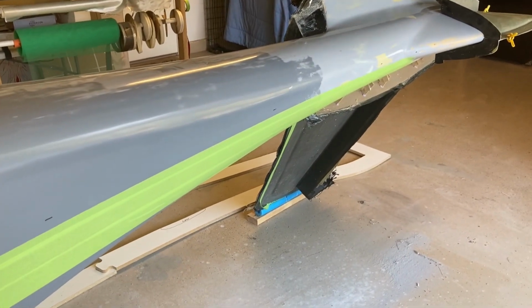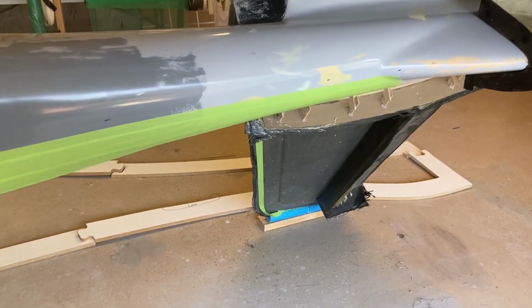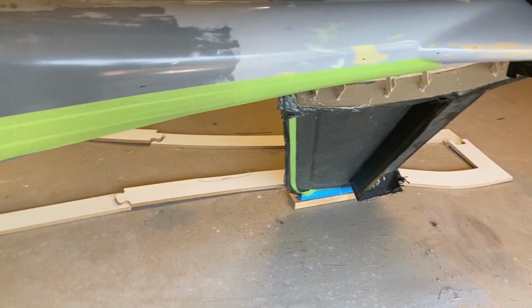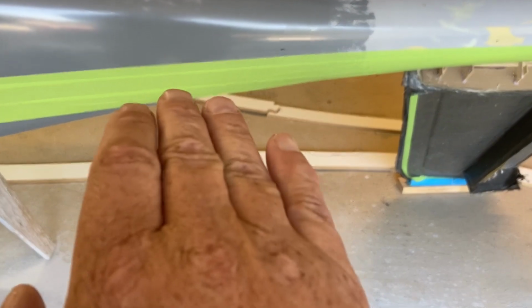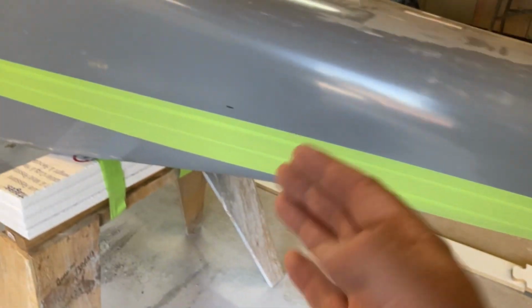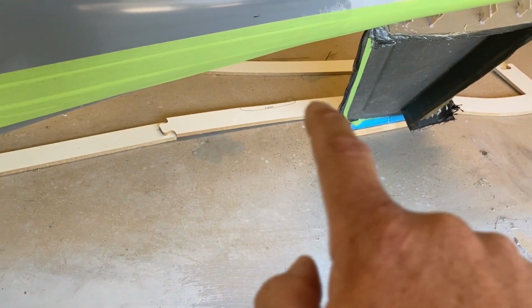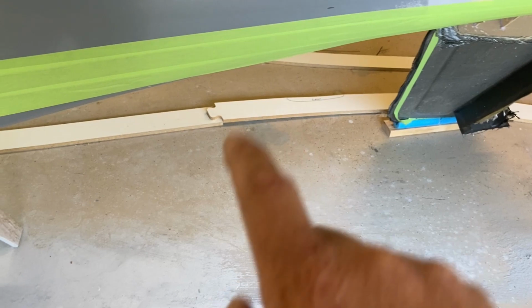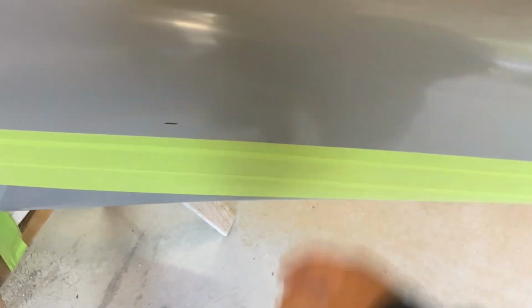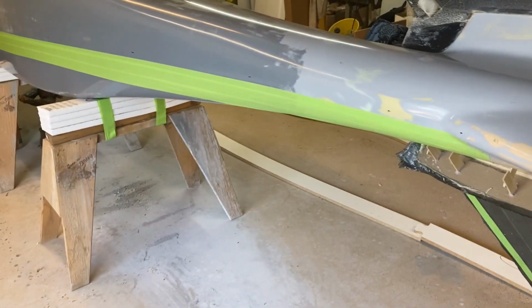I'll go through the process of how I make my splitters as I'm doing it. It's a little bit unique. Well, maybe not. I think a lot of people probably do it this way, but it's cut close, but it's not an exact fit. And what I do is, once I get all the supports made where the splitter can sit there and made up against the plug, I fill that gap with Bondo. And since the plug already has a few coats of wax on it, the Bondo releases very easily. And then once the Bondo's off, I will sand the Bondo flush with the top surface of the splitter plate. And that provides an absolutely dead nuts, watertight seal to the plug. And if there are any gaps, I use a little bit of filleting wax and fill that in.